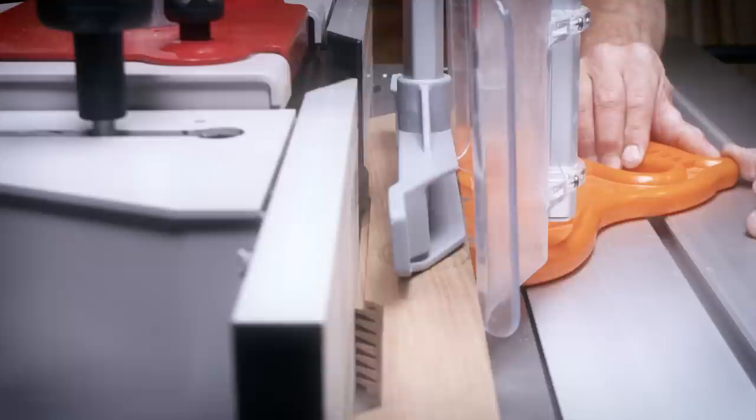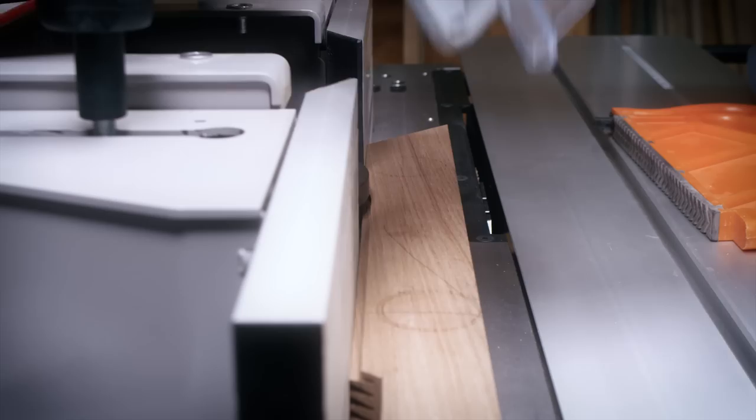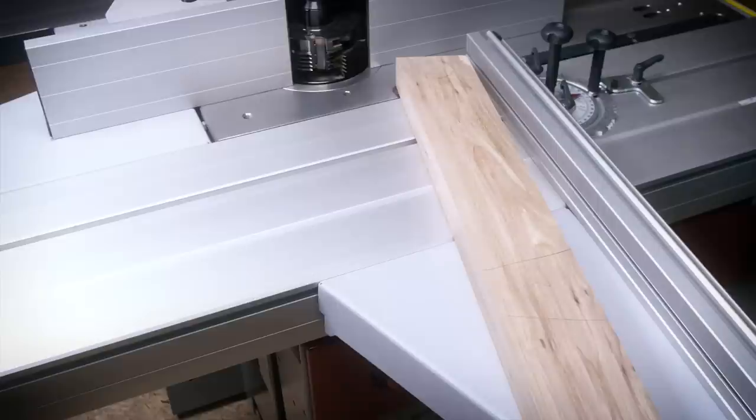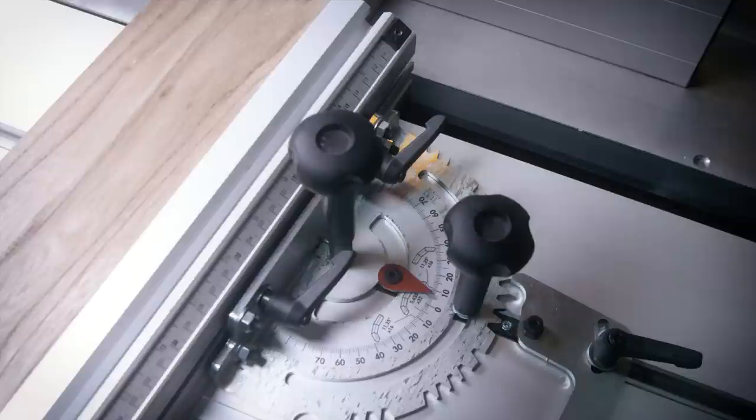Once the area is moulded, switch off the machine. The engine brake stops the cutter quickly, and the next workpiece can be clamped. Pay attention to the triangle markings. When moulding lengthways, the markings should be on the top side. This means that the centre bar must show the triangle markings on the bottom side. The cutting angle is set to 7 degrees.